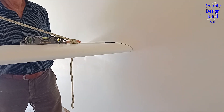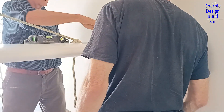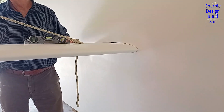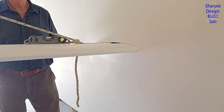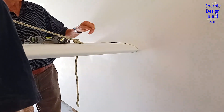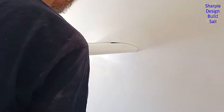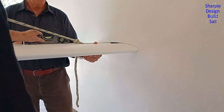This is the highly critical part. There's quite a bit of difference in alignment — so that's that way. That looks good. Is it actually entering at all yet? It's nice and loose there — not quite entering on that side though. Oh, that's in — it's in both sides! It's in about an inch. Now keep a real close eye on the level too. So that's a bit sloppy there now — I'd better just check the boat hasn't shifted. I'm going to keep it at the same angle, so the bubble should be right up to that line. You need to go down a little fraction.